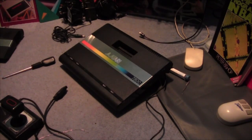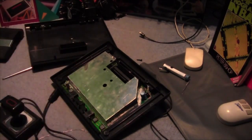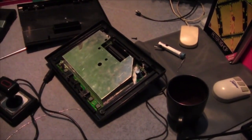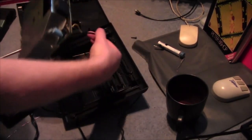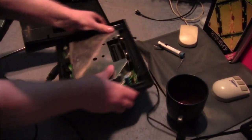We did try to mod it at first from behind to make it work but that wasn't successful. What I have done, inspired by Psycho Fox whose video I'll link to, I've done a mod. I've taken a Sega Mega Drive power adapter — 10 volts at 1 amp. The 7800 itself takes 9 volts at 1 amp, but the voltage is very close; it's the amperage that is more important. I've desoldered and removed the original power brick and soldered in wires to the terminals where the ports used to go onto the motherboard — positive and negative.